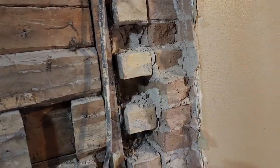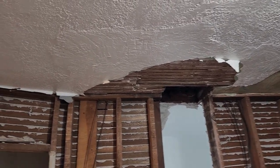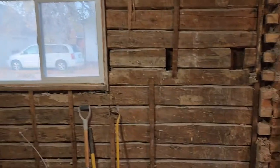We'll frame this wall up, which will bring it up, and then we'll be able to sheetrock to that. With it being two-by-six or whatever, it won't take much. We're also going to end up taking that ceiling down — I'm not going to bother scraping all that plaster off, I'm just going to climb up there and kick it in. So that's what we've done here at This Old House. It's coming along slowly but surely. Thanks for watching, and like to say: if the women don't find you handsome, they ought at least find you handy. You guys have a good day and we'll chit chat at you later.